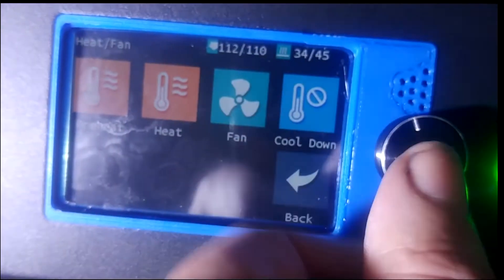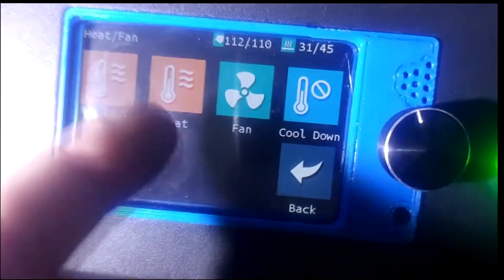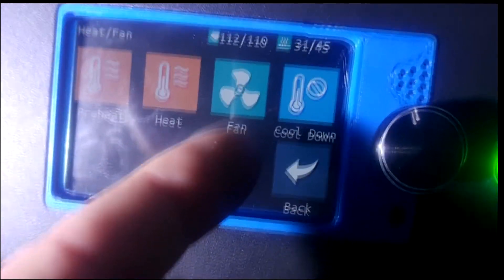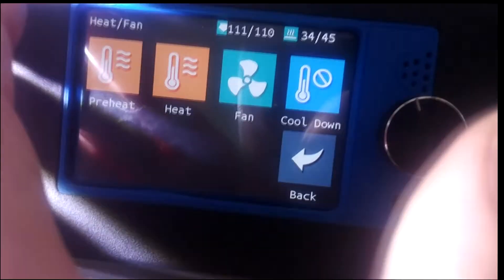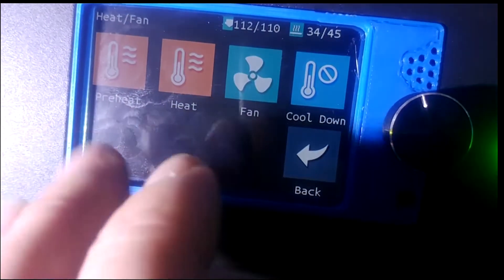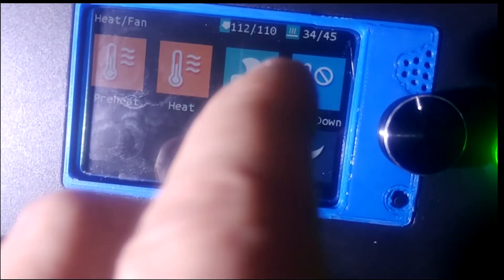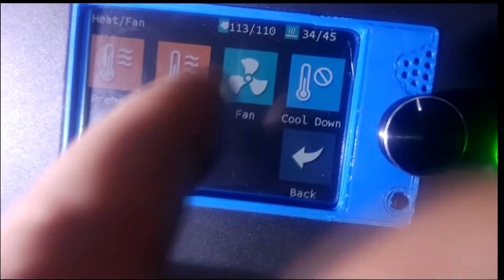The control knob doesn't do anything except if you press it, it goes to the LCD 12864 settings. Now that isn't set up right — you'll have to set that up in Marlin. I haven't set that up, I haven't flashed this. This is just default, so I presume it isn't set up in Marlin — you have to actually tell it that you want the LCD 12864.